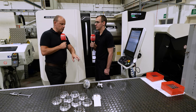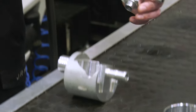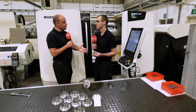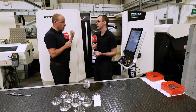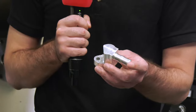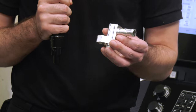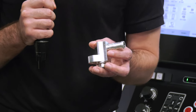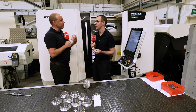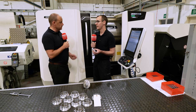This is a component that you actually make on this machine. If you could just pick up the finished part — this really is the topic and focus here — because previously how would you have made this before you had all the additional capabilities of this machine? Basically it would have been one turning op and then two milling ops to complete this component. And now we can do it in two ops, turning and milling on this machine with live driven tooling, and then a second op to machine the second side. So you're utilising the C axis and Y axis to make this part far faster? Yes.